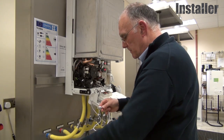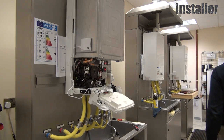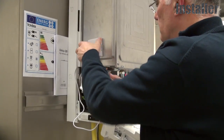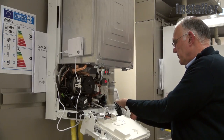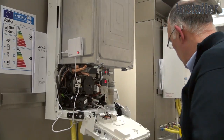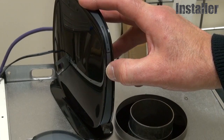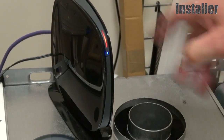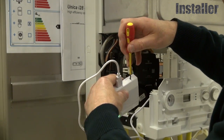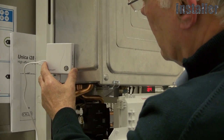The connecting cable is now connected to the receiver. The boiler is now powered and the gateway is also. The next step is to connect the gateway to the internet. With a small screwdriver, press and hold the WPS button on the cable so that the lights are flashing. After a while, that should establish a connection.